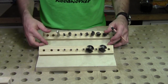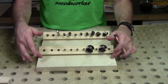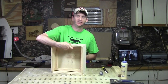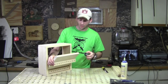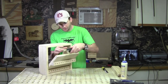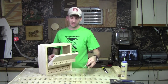I could have put three rows on here, but I don't have that many router bits, so I just went ahead and added two rows. If I wanted to add three, I would have dropped this one down a little bit more and added another row of bits up here — it will accommodate three rows of bits just fine. I've got the false panel installed and I went ahead and installed the hinges. On the back side of the top piece of the frame, I'm just going to take a small hand plane and remove this corner a bit — a sharp plane makes quick work of it.